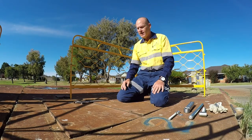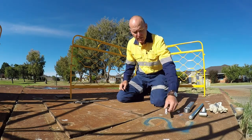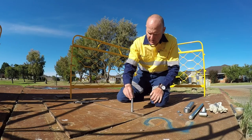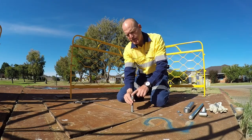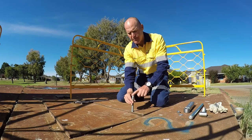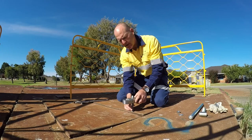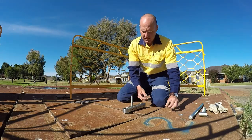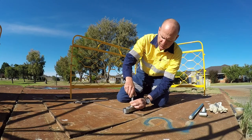We're out in the field and what we've got here is a set of manhole covers tightly fitting. We'll put in our T-bolt into the Gatic-type slot. Turn that 90 degrees — you can tell by the tongue that it's turned 90 degrees as we talked about before. We get our load bar and put our load bar on top.